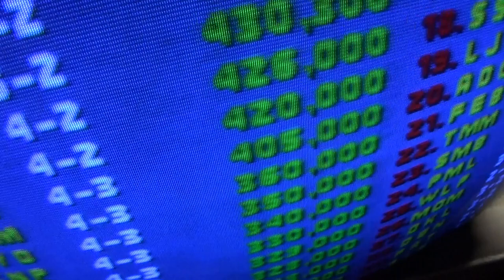Okay, so if we look down here on the bottom, you can see it's folded over on itself. So let's get our 50-60 hertz pot adjusted here quickly, and there you go. Perfect. Okay, vertical size now is too big. Let's go back down on that.